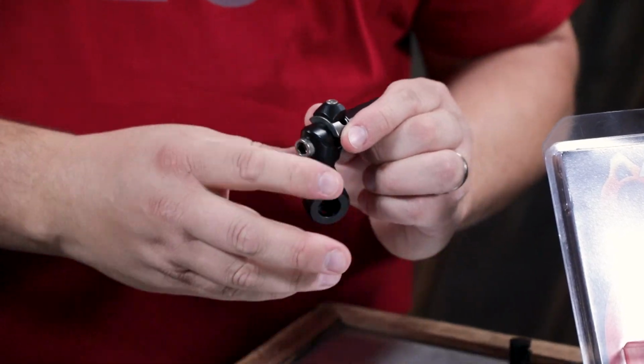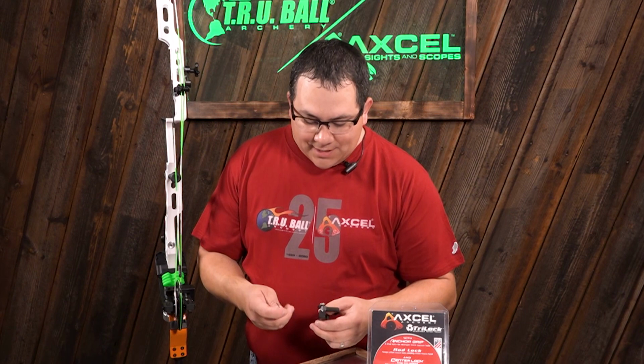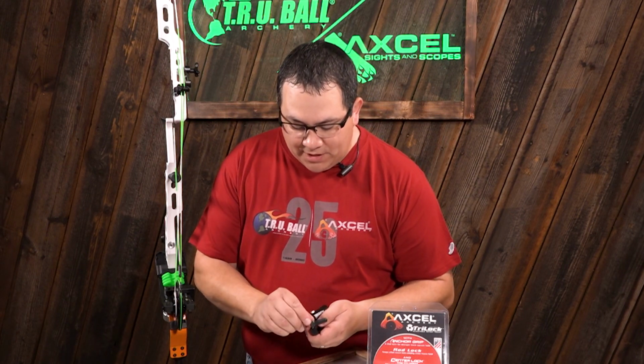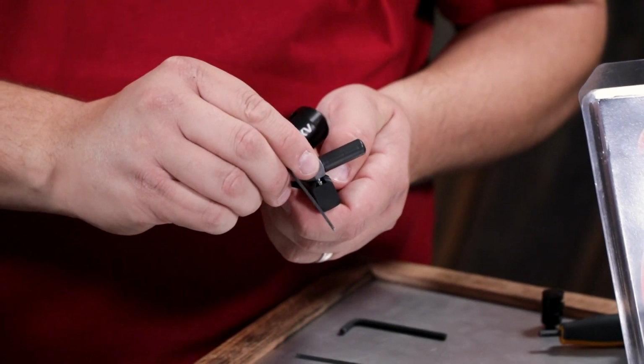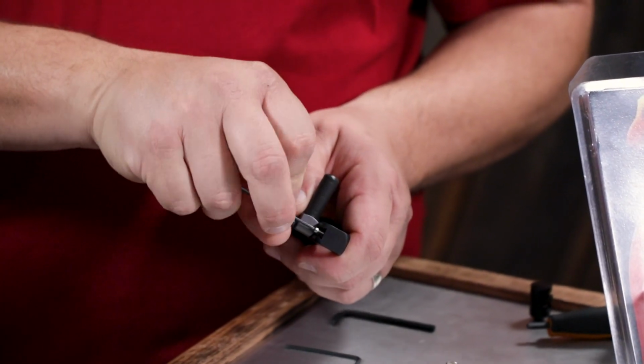and then put our anchor grip screw back in and snug it up. And then the next thing we're going to do is take a 1/16 Allen wrench, and there's a safety screw that keeps this dovetail piece from coming off, that you're going to remove and set aside because we'll reinstall it shortly.